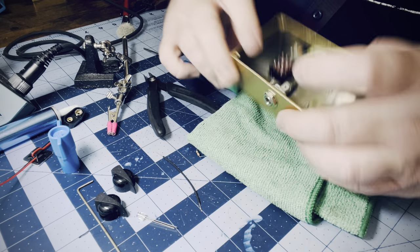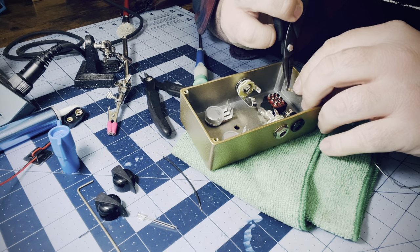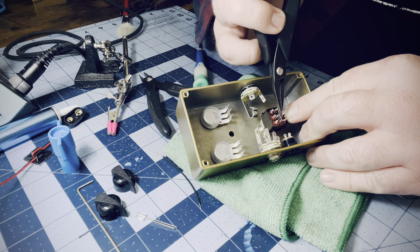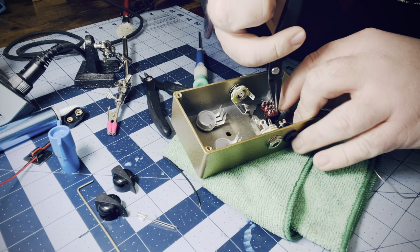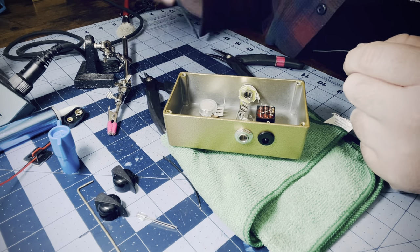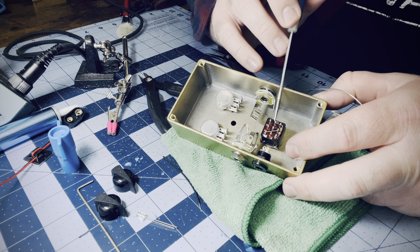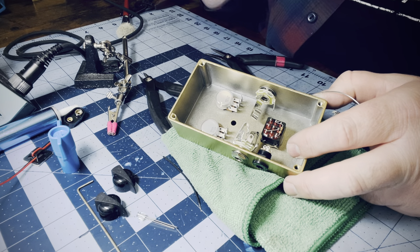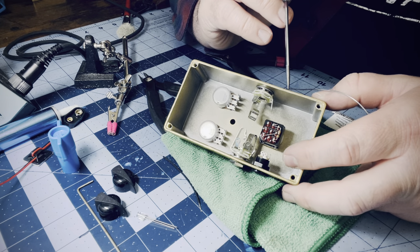Looking good here. This is our bypass — it's going to go from the input plug on the jack to here. If it's in bypass, it goes through this and then out to the output jack. This is a nice symmetrical layout — it's pretty common. You don't need to have this extra piece of wire right here. Technically when the switch is in this position, this will be joined internally. But it's nice if you want to reduce some of the noise from that switching on and off — it'll be just permanently switched and won't affect the bypass sound or quality. It's also a redundancy should that part of the switch fail.